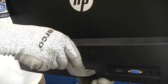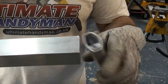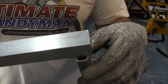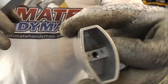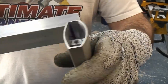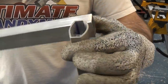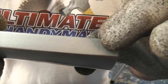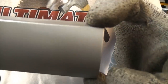We now need to fix that part to a piece of box section which is quite difficult. There is actually a threaded hole in there so I could drill straight through the top and screw it in that way, but I'm not keen on doing that because all the weight is being held just on that bit of threaded aluminium. So what I'm going to do is drill straight through there and through the box section and put a large bolt through - in fact I'm going to use a piece of 8mm threaded bar because that's all I've got that is long enough. I've marked that ready for drilling, I'm going to centre punch it and then drill with a 5mm drill bit first and then an 8mm clearance hole.